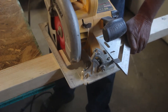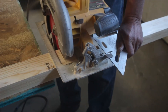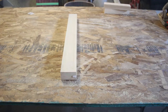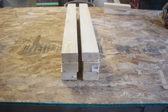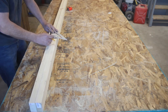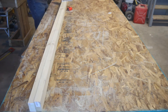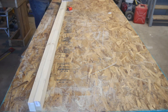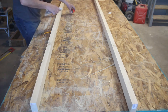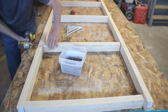I'm using my skill saw and a speed square as a guide to cut all my joist members to 30 inches long. Now that all the framing pieces are cut, assembly is as simple as building a wall. I want my joist spacing to be 24 inches on center, so I'm drawing a line every 24 inches on my two 8-foot lengths, then adding my 30-inch pieces and screwing it all together using 3.5-inch deck screws.